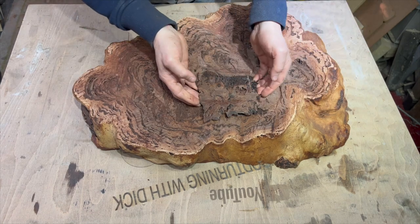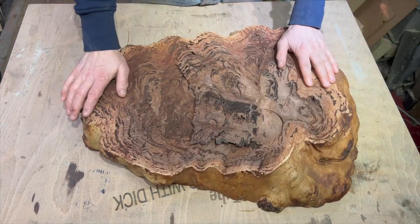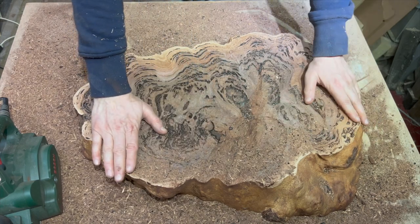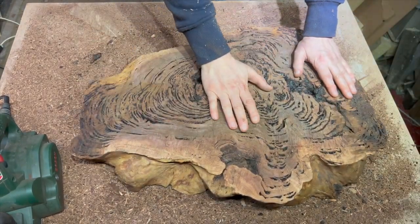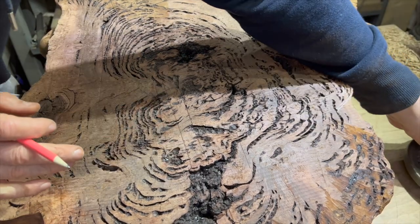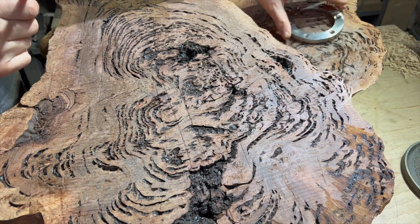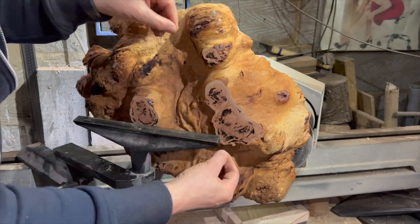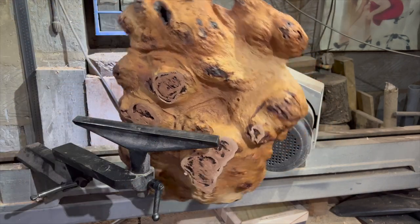I've got a lot of flattening off to make this a usable piece. I only had a shortish chainsaw which wasn't going to cut perfectly straight, but neither here nor there. This is going to be the back. You can only make this the front now - find the centrally weighted point, which is right there. I'm going to put my big face plate on this. The smaller burl in the background I'll find the weighted center on my spike and put the smaller face plate on. I want to make these the same height so it sits on the wall at the same height, with French cleats, and dig out enough here to get a chuck grip in there. This is video part one of two.